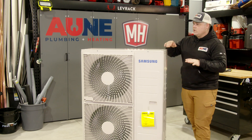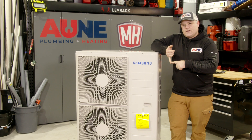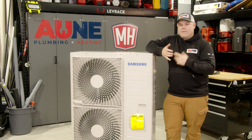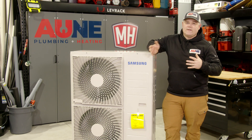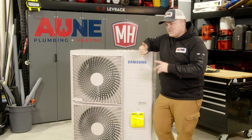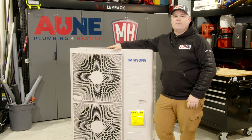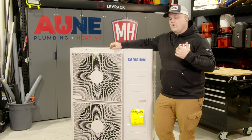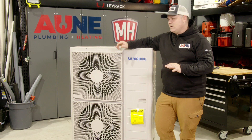So that's what we're doing with this unit — we are replacing just a standard unitary air conditioning system. My house is 21 years old, so we're putting a new furnace into it. It was just a great time to do both. I wanted to use the Hilux unit because we're going dual fuel, using the heat pump as a heat source from full capacity down to five degrees Fahrenheit. So it'll be nice here in Minnesota.